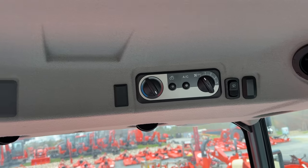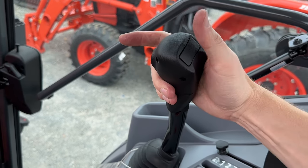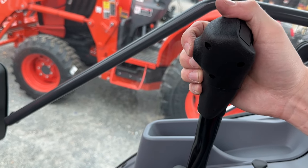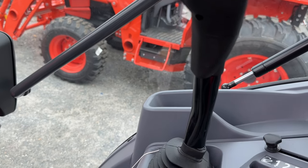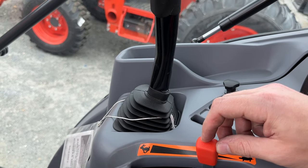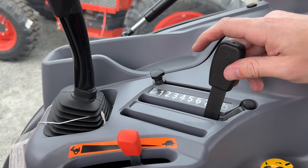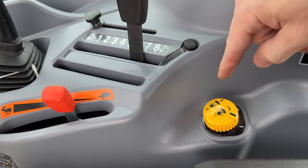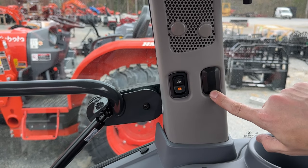You've got a spot for a radio, air conditioning, and heat. On this side you have very nice ergonomic loader controls, and there's a throttle button on the front of the joystick — push it and it throttles up to max RPM for heavy loader work so you can keep a constant engine speed without reaching for the throttle. This lever raises and lowers your three-point hitch. This is your PTO engagement — to turn on your bush hog, tiller, or auger — and there's a spot for additional work light switches.